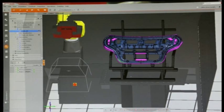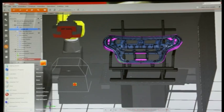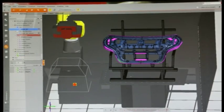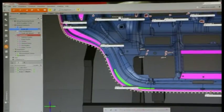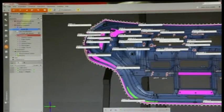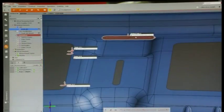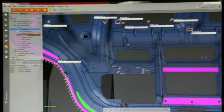In this case, I've already brought in the inspection plan. In here I've brought in surface points, slots, holes, and trim edge points. For sheet metal inspection, a lot of these features are what they inspect. They'll inspect trim edge for spring and trim, slotted holes, circles, and surface areas or surface points.